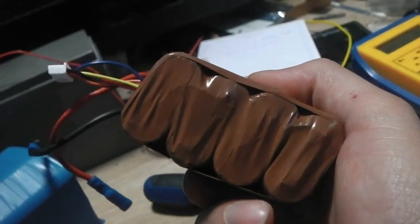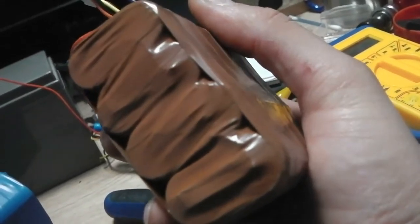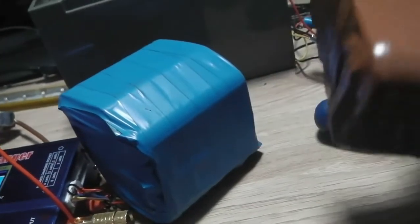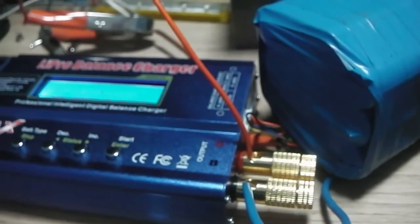I'm going to plug in the other battery - this is the set of 8 TrustFire 4 amp hour 18650s, with 4 in series and 2 in parallel, so we should have 16.8 volts in theory. I'm going to charge this up, balance it, and run the test again tonight to compare the used salvaged batteries with the brand new batteries. This is a 16.8 volt 7.2 amp hour salvaged pack versus a 16.8 volt 8,000 milliamp hour brand new pack.